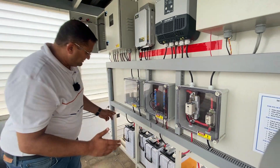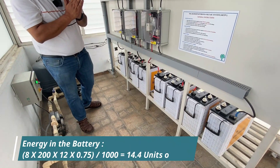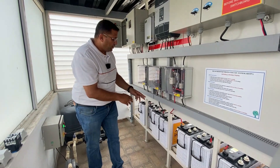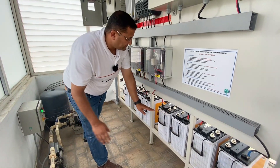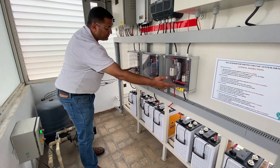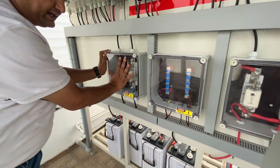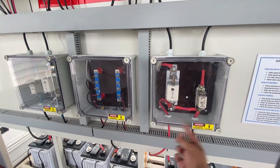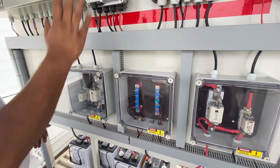For this particular system, we have 8 batteries each of 200Ah — 12V 200Ah. 4 of them are connected in series here and the other 4 are here, each group making 48V, made parallel on this bus bar. There are two fuses — positive side fuse and negative side fuse — with two inputs so that there is no shorting or looping on the battery side. The parallel connection is made here on the bus bar, and this is the off-grid inverter.